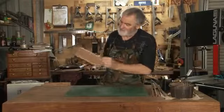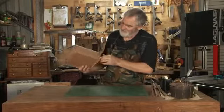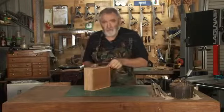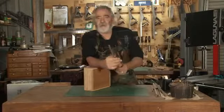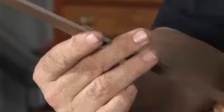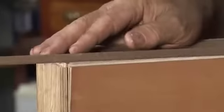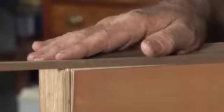And as you can tell, I put some saw cuts around the box. Now the depth of cut is 8mm square, and that's what I've made some square stock. Just get a bit of board, machine it down to about 10mm and make sure it's square. And then if you cut 8mm grooves or 8mm slots in your box, these will fit in nicely with a little bit for cleaning up. So the rest of the rebate I'll do on the router, and we'll go over there and do that now.